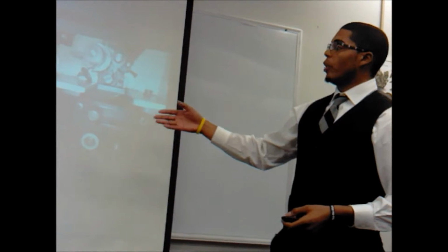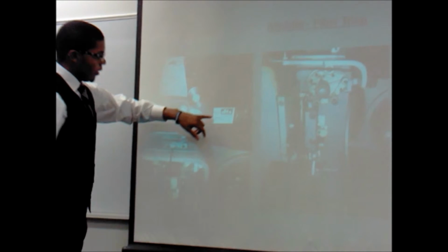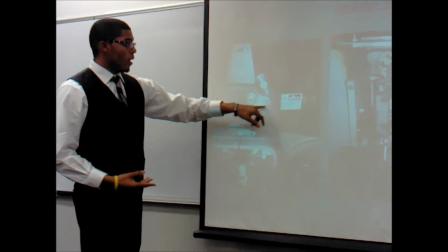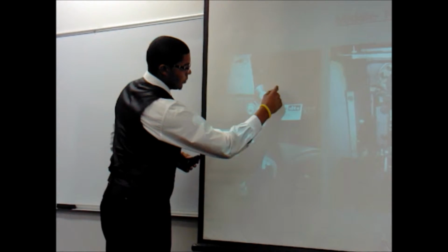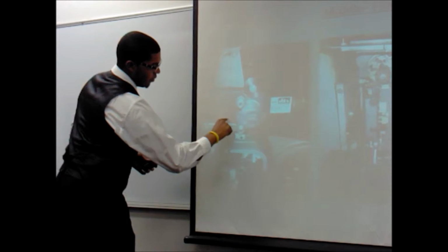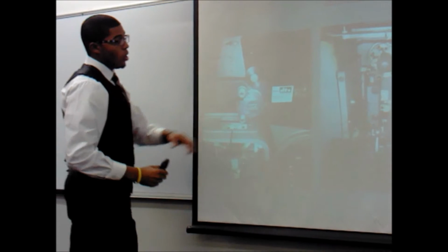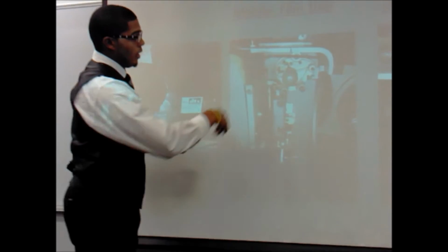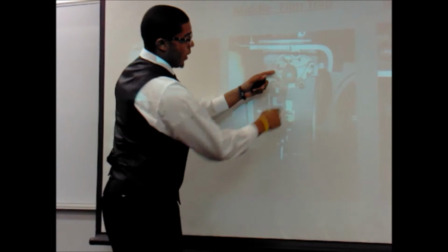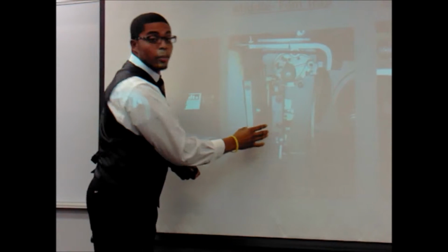This right here is the 3 parts of the projector. As you see right here, the DTS is going to play the 2 CDs that I showed before. We feed the film in a kind of S formation all the way to the middle part of the projector, which looks like this. Once we get to this part of the projector, we feed the film upwards with a loop on the top. Once we do that, we feed it to the middle part, which is the film trap.